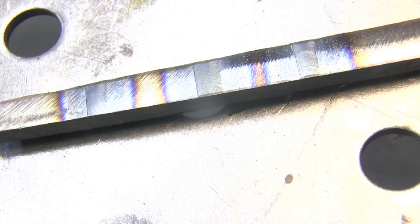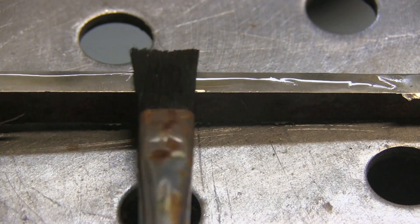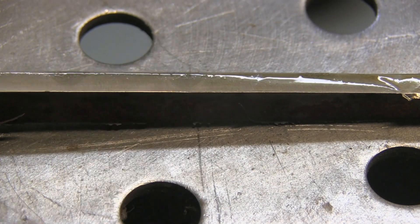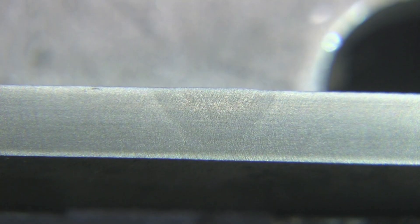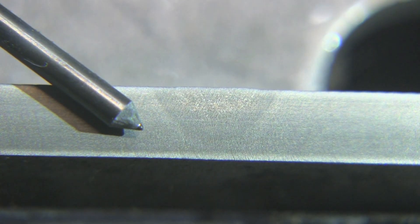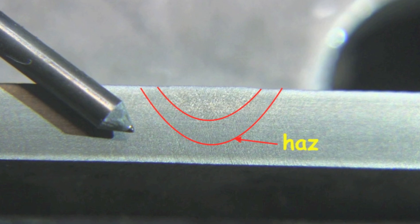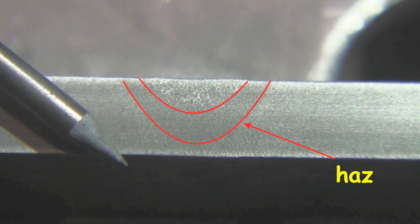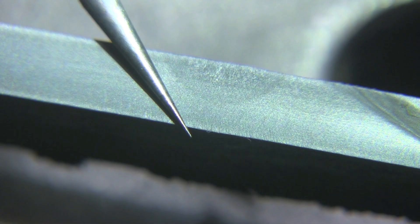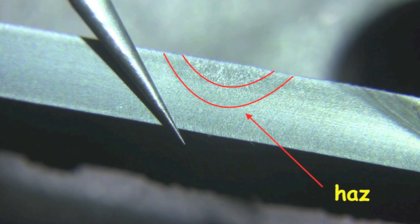A little polish on the cross section — the better you polish something, the easier it etches. I didn't have really good polishing equipment that day, so I just used Scotch-Brite. The acid etch is a passivation solution normally used for stainless steels to remove heat tint. That's the result from the first electrode prep. The big area is the heat-affected zone; the smaller grainy area is the actual weld nugget. The second more-tapered electrode, and then the needle-sharp electrode — everything is shallower there: the heat-affected zone and the weld nugget, just like the books tell you.